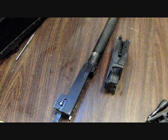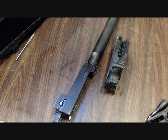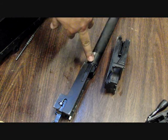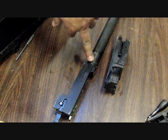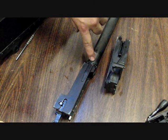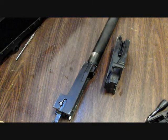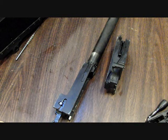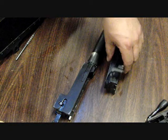I think the square Israeli notch is a superior design over the GI rounded notch. You cannot lose headspace with the square spring. I have lost headspace trying to use the round GI spring with the square barrel profile notches of the Israeli gun. If you've got a full auto 1919 and you trust it, have at it — I personally don't recommend it.